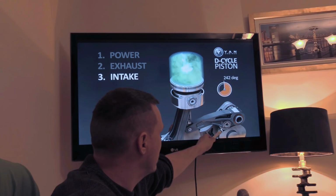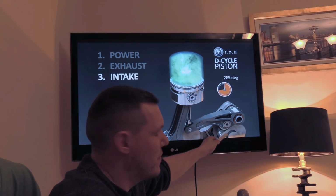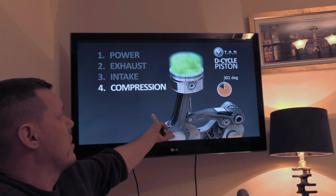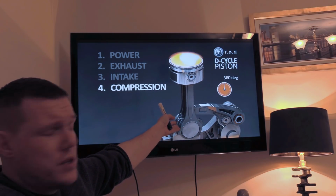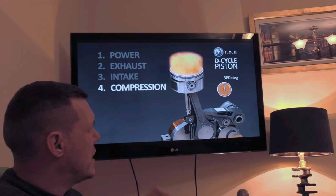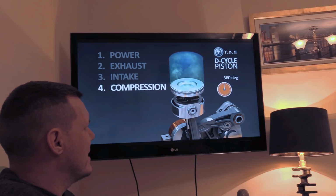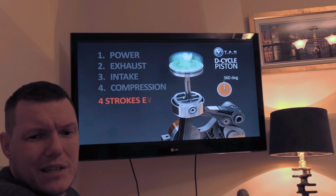Unless there's a spring, that's just gravity following this cam profile, that neat cam profile. It works great in SolidWorks models or CGI or whatever you want to do, it works great because you're telling this roller just to follow that profile. But in reality, it doesn't mean that that's going to happen.